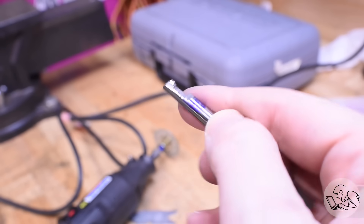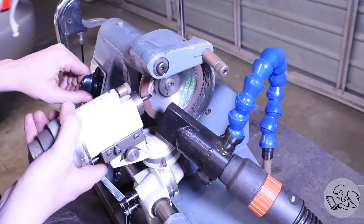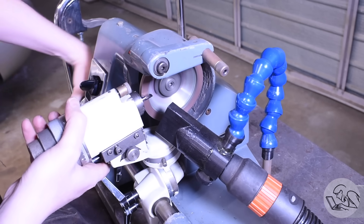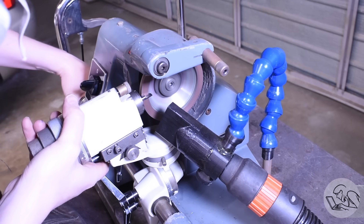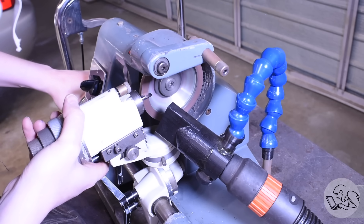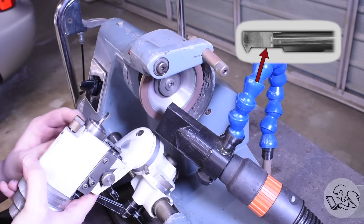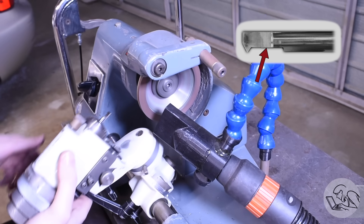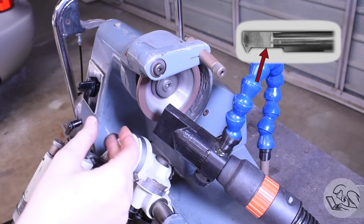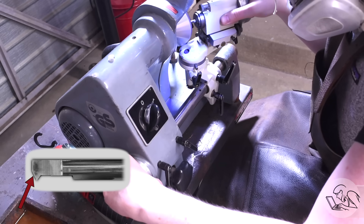This is all very rough, but you can still see the lines on top and we're close enough now to bring in the D-bit grinder. I'm going to use the D-bit grinder because I have one, but you can also do this with a Dremel with a diamond wheel or grinding stones. You don't have to have a D-bit grinder. I start by plunge grinding the area behind the thread cutting point to clean up the rough grinder marks. The tool is at a 10-degree angle, so I'm cutting clearance on the underside of the flat area. Then I switch to the outside edge of the thread cutting point, cutting that also with the clearance angle underneath.